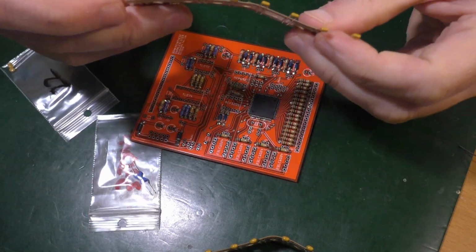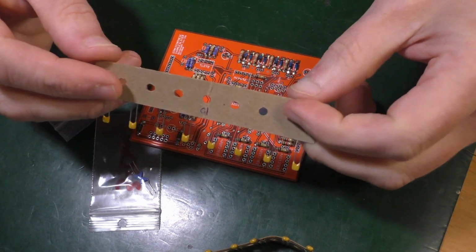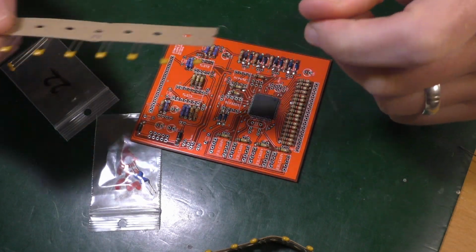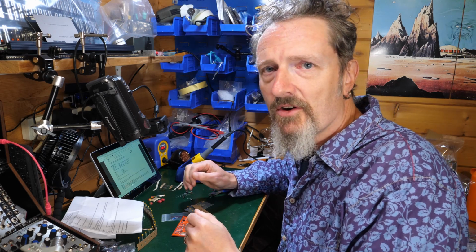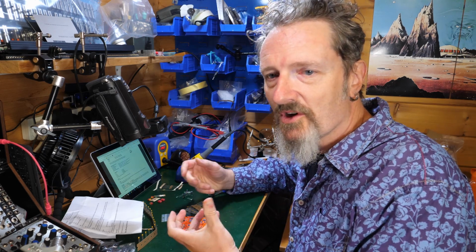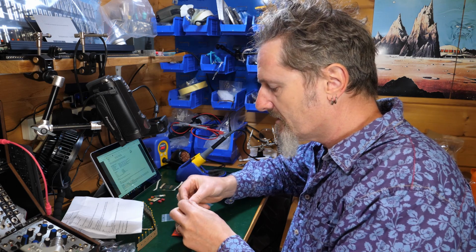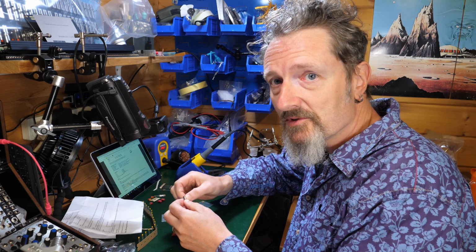Alright. Oh, and just to say that these sorts of capacitors, they're not polarized, so they can go in any way round. Doesn't matter which way round as far as orientation goes. Because I got told off about not saying enough about orientation, so I'm trying to overdo the orientation. It's like with the crystal, right? I don't believe that's got an orientation either, so you can go it that way up or this way up. Alright?